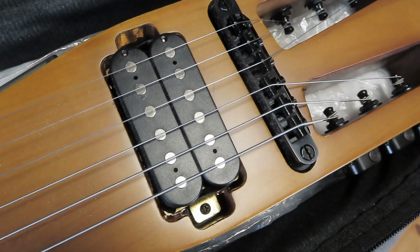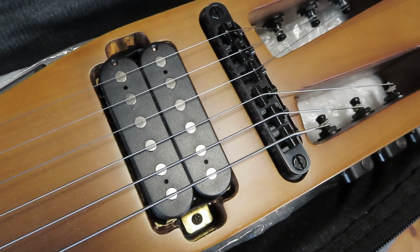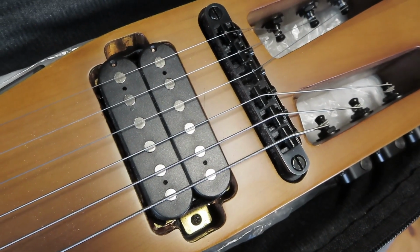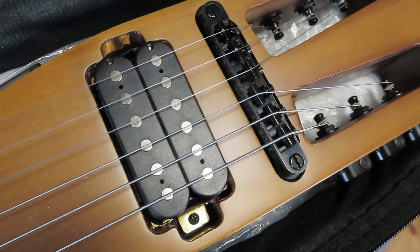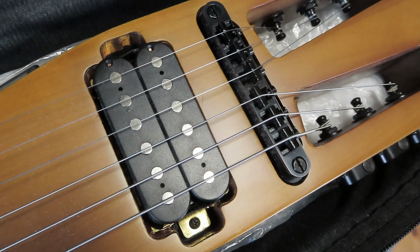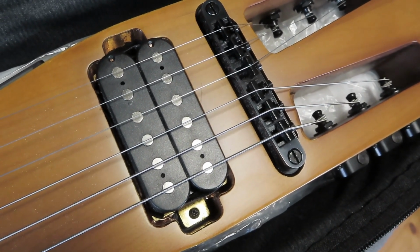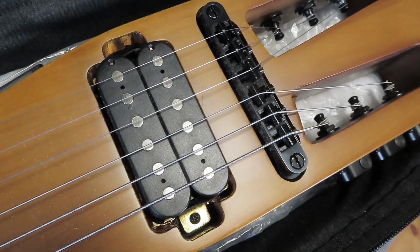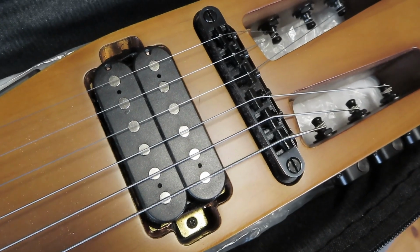The bridge has to make contact with the sleeve of the jack, which is the grounding part of the jack, either indirectly or directly. So it can connect through the shielding or through a direct wire. Usually a direct wire is used because it's a way to make sure that the contact is good.